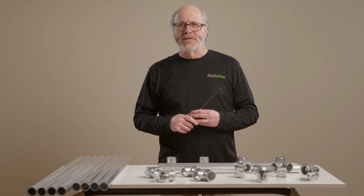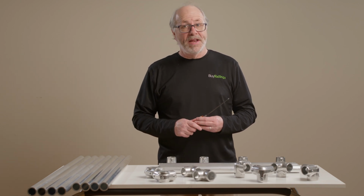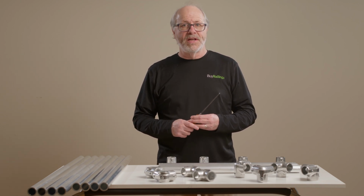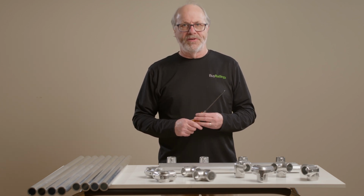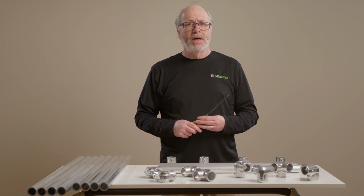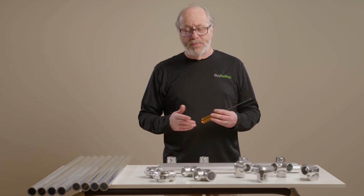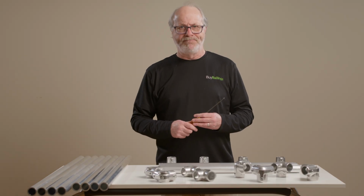4 vertical posts cut to 35.5 inches, 4 horizontal crossbars for the table's width cut to 32 inches, and 4 crossbars for the table's depth cut to 24 inches. We are using 1-inch IPS mill finish aluminum pipe, but you can also use galvanized steel pipe if preferred. By the way, we will have links to all of these items in the description so you can easily see exactly what parts we are using.